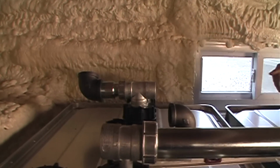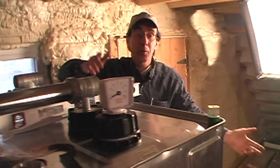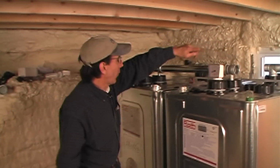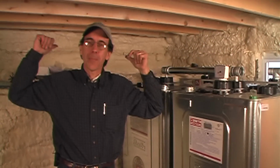Now, before we put all this together, I have to put this pipe in between, which I didn't do. So I'm doing it backwards because it's my TV show. The oil burner man's not here anyway, so we're not going to do the rest of the plumbing. But it's that simple. And one is the vent. This would be the fill. That's the vent. Two pipes going out the building. Looks as clean as it's going to look for getting oil delivered to your house.